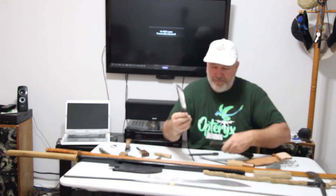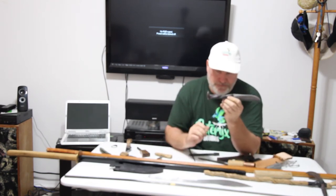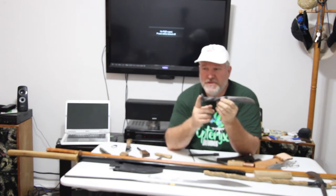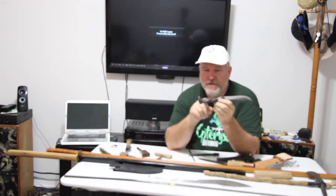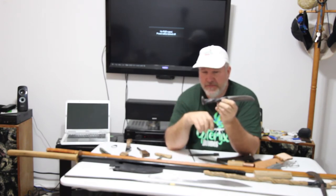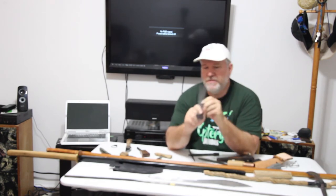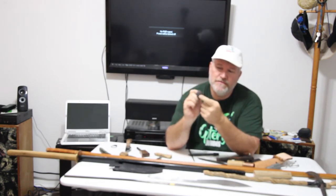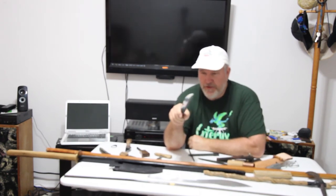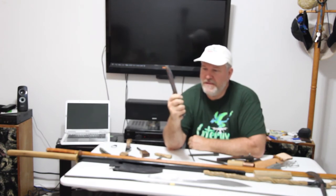And then this is one of my favorite railroad spike knives. I'd like to make a video maybe of making this. I'm sure there's plenty people have shown this. The pineapple figure is where you take a cold chisel and you go down all four sides and you twist it, and then you chisel down all four sides and untwist it, and it makes a pineapple. Of course, HC is supposed to be high carbon. If it says HC on the end, it's high carbon.